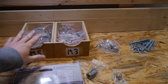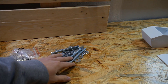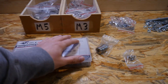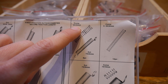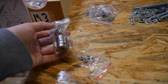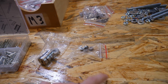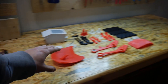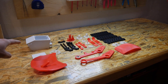I almost forgot about screws — we need M5, M3, M2, and M8 screws with washers and nuts. We also need some springs; I have a whole set but I will only use the one that's 9x35mm. We also need some bearings — big bearings and small bearings. I will put the bearing names in the description along with links to all these components, and also a link to my Thingiverse where you can find all of the STL files.